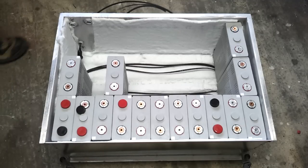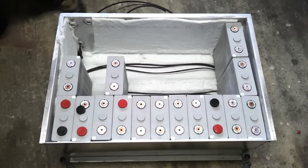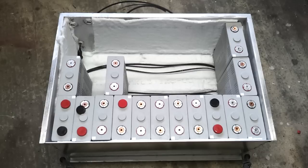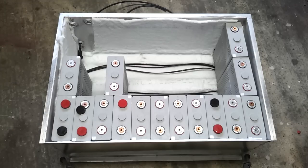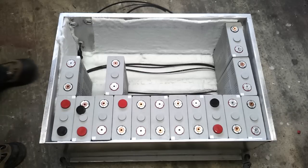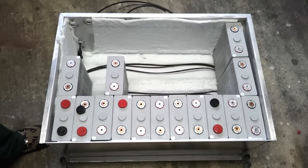What I'm going to do is install all the cells, strap them up, do a few tests, pull some energy out of the cells, plug in the heating tape, and have a thermocouple in there - leave it on all day. It's fairly cold ambient temperature; the workshop today is probably only three or four degrees centigrade. I think that self-regulating heating cable might just work quite well. If it doesn't, we can put a thermostat or a switch of some form on it.